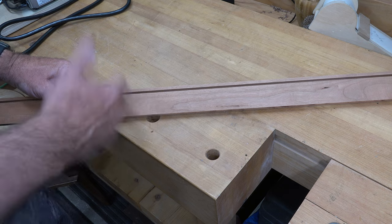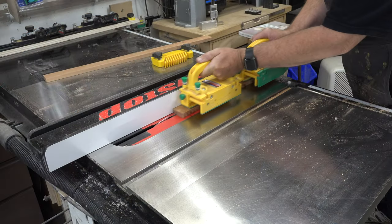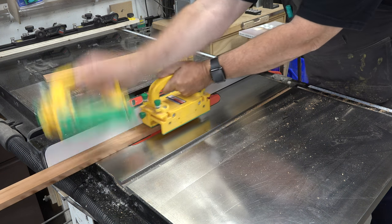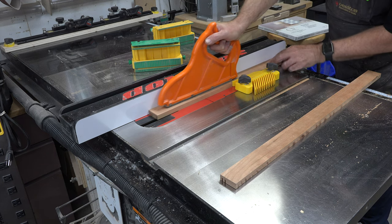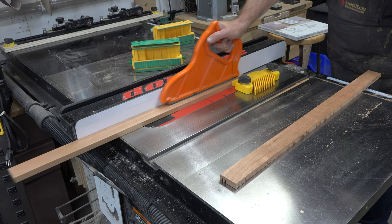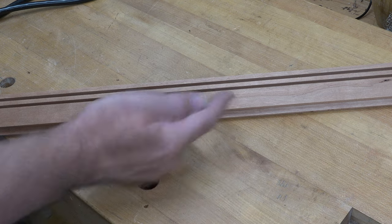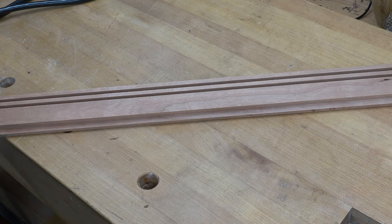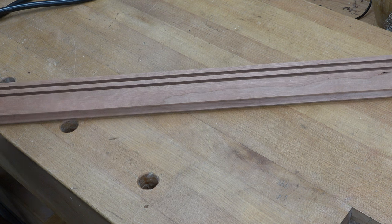After you've tested that your mirror will fit in this groove, we need to cut another dado exactly the same but bring it down another three sixteenths of an inch, leaving a three sixteenths inch gap, and run a second one eighth inch wide dado. The last cut we need to make on our stock will be a rabbet on the back end — five sixteenths of an inch deep and a quarter inch wide. You should end up with two one eighth inch wide dados at the front and a quarter inch by five sixteenths rabbet at the back.